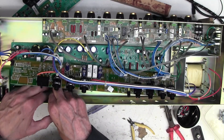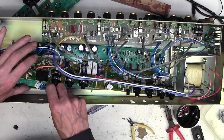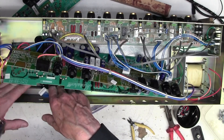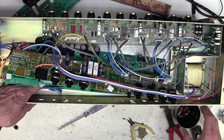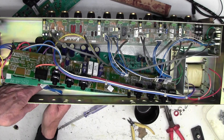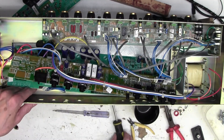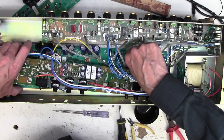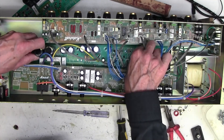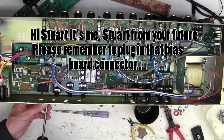Let's see if we can get this back in here with this little sub-board, the connector of which has disappeared underneath of course. We need that out the top. I think we can put this sub-board in without removing the main board. I'll pop one screw in. I think from memory the main board will go down around it. Once it goes, it goes. Now before I forget, I'm going to put the second screw into the little sub-board - that's a good contender for forgetting.